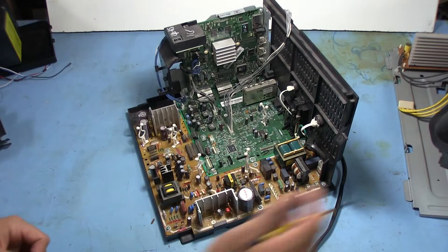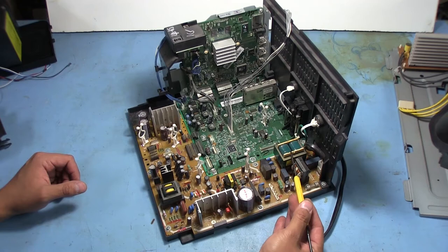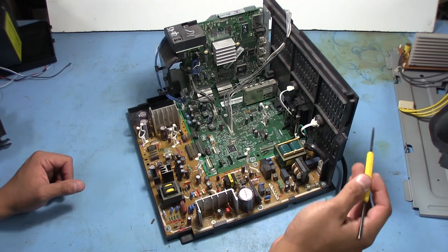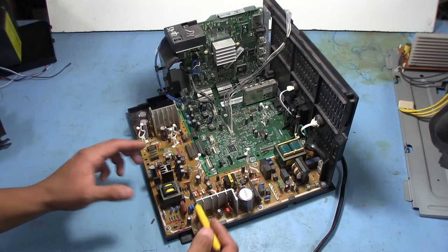Let's start off by looking at the input and power supply sections. We're going to save the projector for last because that's where all the interesting projection stuff is going to be. So we have our power coming in here, and it looks like we've got some filtering. This right here almost looks like a choke, but I think it's actually a transformer. We'll remove it and look at the bottom to see what's going on. I also want to see what this connector here goes to — it goes off to the power supply for the lamp, and there's quite a few wires going to that.